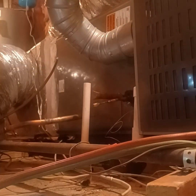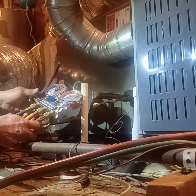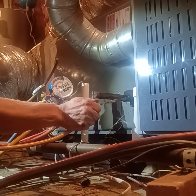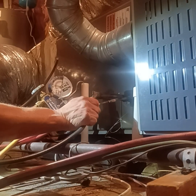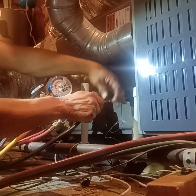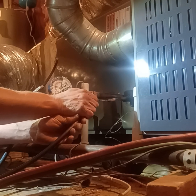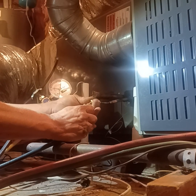Okay. Gauges, please. Hand me up the nitrogen, Joey. Yep. And I will hook that up. So they had the line sets capped right up here. The line set, yes. Okay. I was only asking because they pressurized both lines separately. Oh, they did. Yeah.